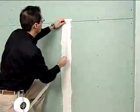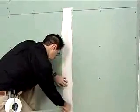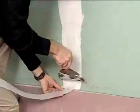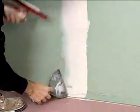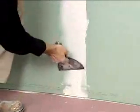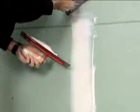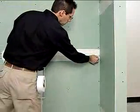Now place the FibaFuse tape over the seam. When you reach the end of the seam, FibaFuse is easily cut with your drywall knife or by hand. Use your drywall knife to embed the FibaFuse tape. Because FibaFuse actually fuses with the joint compound, less compound is actually needed. FibaFuse is versatile. It can be used on any seams, recessed or butted, flats or corners.